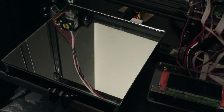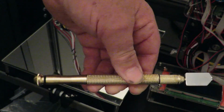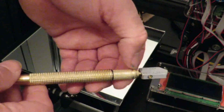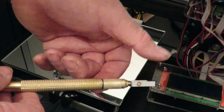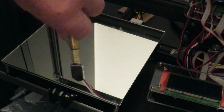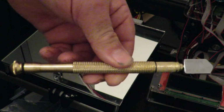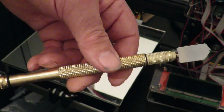And I suppose I should really talk a little bit about the glass cutter I've got. It's quite inexpensive. They're an oil-filled one. You can pick this up from GearBest if you like. Not too bad. You just unscrew this little section here, put a few drops of oil in. Don't need much, don't have to overfill it, and you just hold it straight down, scribe across in one clean sweep, and it cuts perfect, as you've seen in the video. I'm quite impressed with this. It's the best glass cutter I've ever had, and it's also one of the cheapest. Go figure, eh?